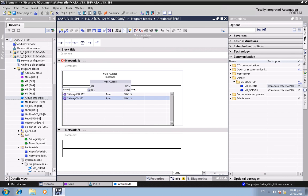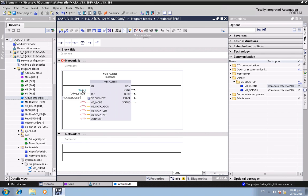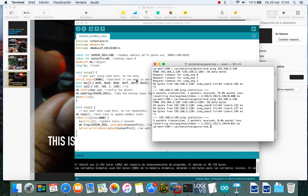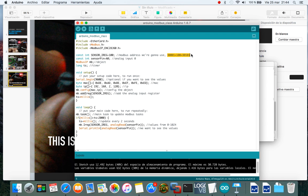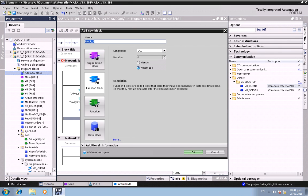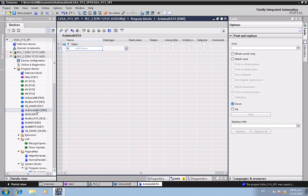Use multi-instance. Set REQ to always true and always false as needed. Set Modbus mode to zero. Set the address to the corresponding register value, data length to one, and for MB_DATA_PTR add a data block. We're going to use arduino_info_data. Click OK — it will be added quickly.